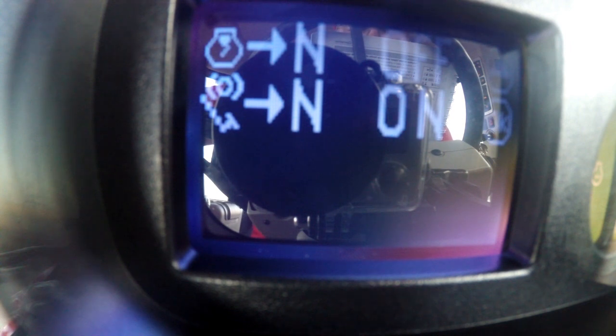When you push this button and apply both brakes, it takes the transmission out of gear. So if you're round baling and the buzzer goes off to tie, you push both brakes and it'll stop the transmission. When you let off, the transmission will continue back at the speed you had preset. Set your ground speed that you want to bale at, hit both brakes, tie the bale. When you're done tying, let both brakes off and you're back to the speed you were traveling — no de-clutching, no moving the shuttle lever. One simple push of the foot and you're bailing more hay.